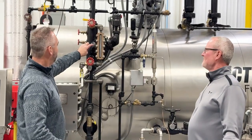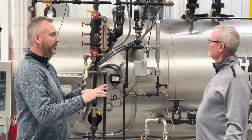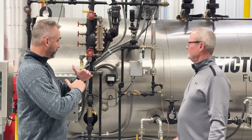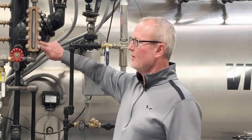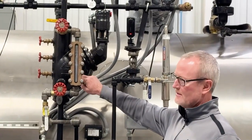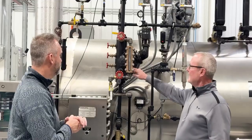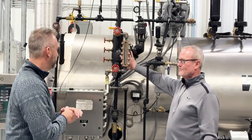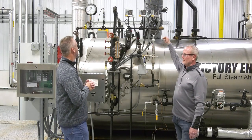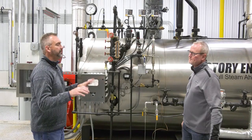The water level is actually above the tubes. Obviously, water getting below the tubes is not a good thing. Even the second cutoff is going to be above the tubes. This line here is the first low water, so from the normal water level you've got about an inch and three quarters down to the first low water cutoff. This control has another switch in here where it will shut the burner down. If something happens and this fails and the water continues to drop, we have a second low water cutoff probe in the top of the boiler. As soon as the water drops off of it, it kicks out and drops the boiler out.